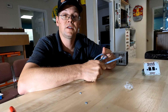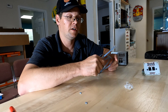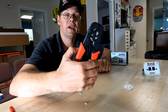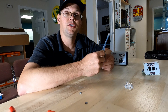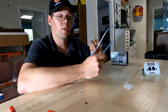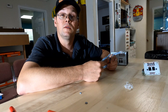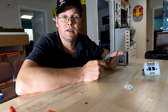Making LocoNet cables for your Digitrax DCC system is pretty simple and straightforward. You need some six-conductor flat telephone wire, some six-pin RJ-12 crimp connectors, and a good crimping tool with a built-in stripper and crimper all in one. This allows you to make LocoNet cables exactly the length you need between your different devices, keeps your wiring under your layout neat and orderly, and you can buy all of this on the internet with a simple Google search. Thanks for watching — leave comments down below, give it a thumbs up, and share it with your friends. See you on the next video.